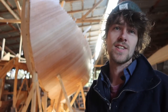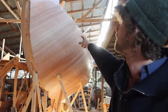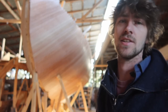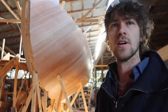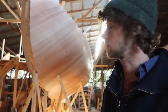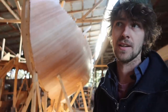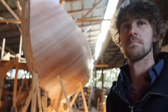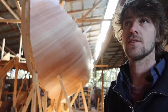So we've almost finished half the boat with our diagonal planking. Made it up to the bow here quite perfectly on a 45. Well, you can't see, but probably got another metre and a half, 2 metres or so to go down aft. The forward section was very easy. She's a lot flatter, less curves, less spiling, you know, less manipulating the planks as you go. So that was quite good. You get a real run up at the bow and finish it very fast.